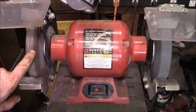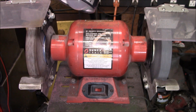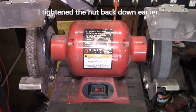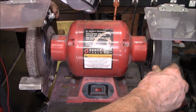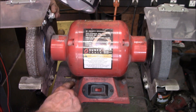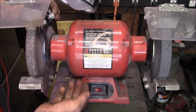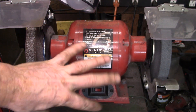Part of the problem is that this coarse grinding wheel got a little bit out of round, so I've been trying to true it back up. This one had actually loosened up. I think all of these things are symptoms of the real problem — you can see right here there's a slight bit of movement in the two bolts I used to hold it down to the pedestal. There must be a couple of screws or bolts up through the base into the motor housing, and that's where the motion is. This whole thing is loose.